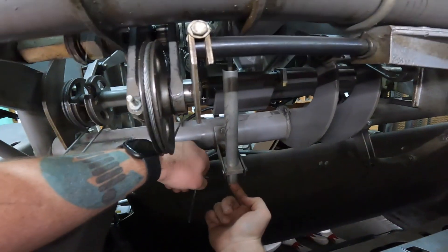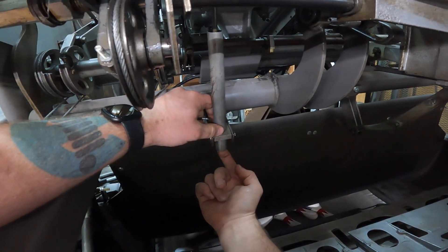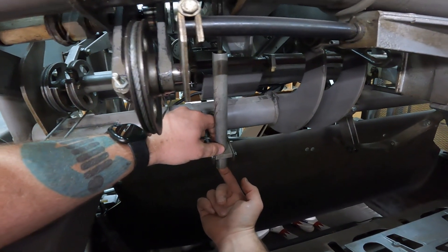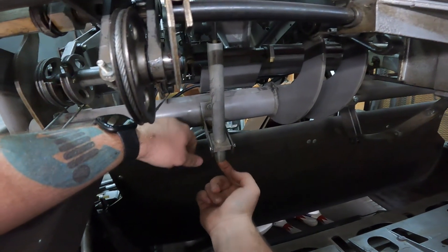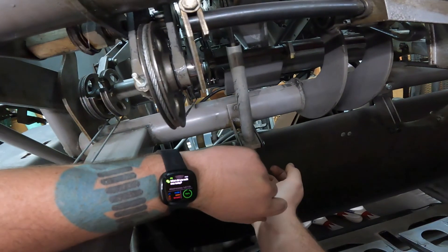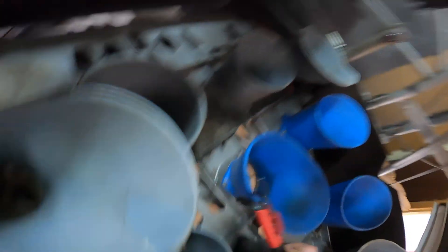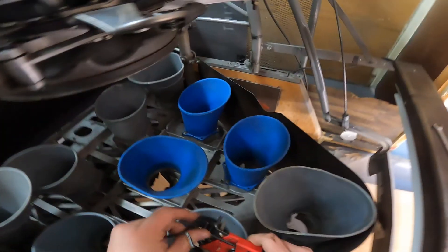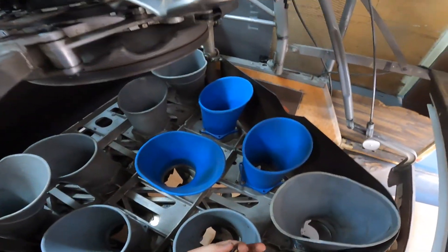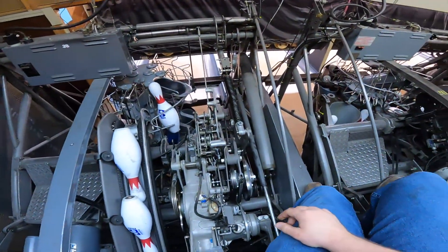When you go next, there should be about an eighth of an inch of movement when you push on the bottom of the rod — it moves up, which is about the same distance that we moved it down. Next, we'll have to go up on the machine again and run it through, check it, make sure that it detects all the standing pins, no pins, and everything else that it needs to. You'll have to run the machine back up to zero.